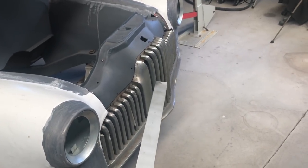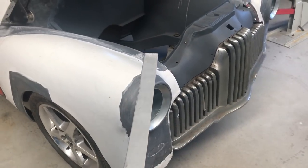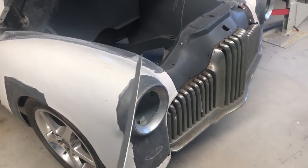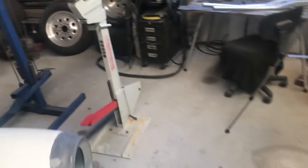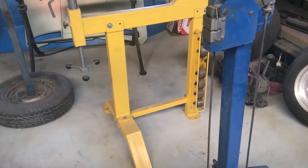When you're cutting pieces out to do a repair or a modification, cutting a curved piece gives you a lot of off cuts. If you're trying to use the smallest amount of metal you can, just doing straight cuts is a lot more economical with your steel.